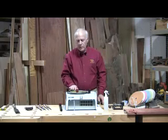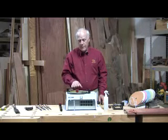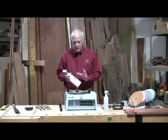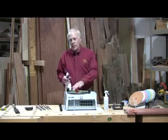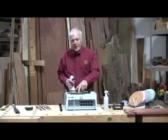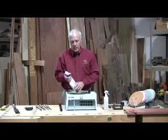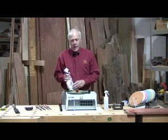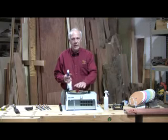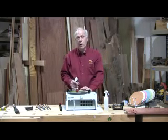For this, we want to use a lubricant such as Formula 409 or WD-40 rather than just water. When working with very fine abrasives, the swarf will tend to stick to the surface of the abrasive and become part of the abrading action. By using a lubricant such as Formula 409 or WD-40, it reduces the amount of swarf that sticks to the surface and it's more easily wiped off, so the abrasive will last longer. On coarser abrasives — coarser than 9 micron — you can just use water.